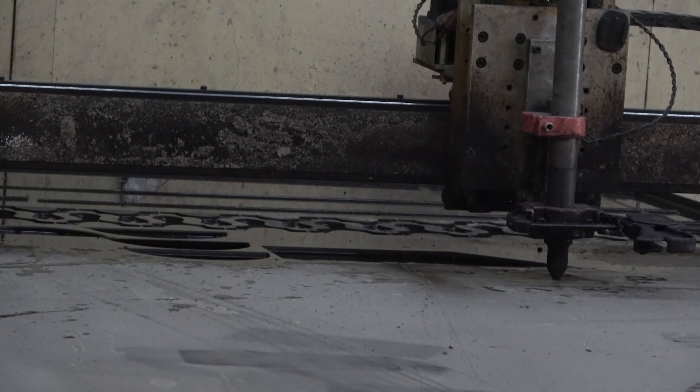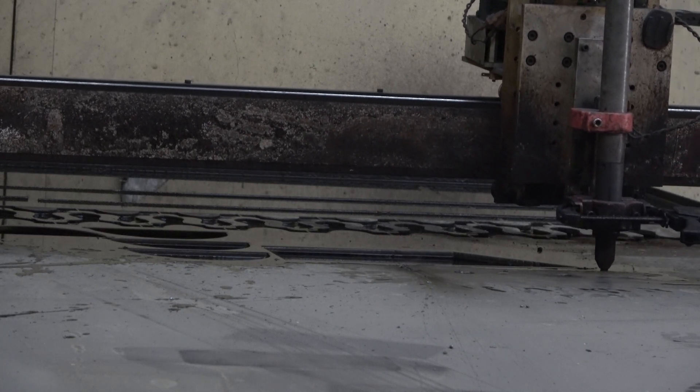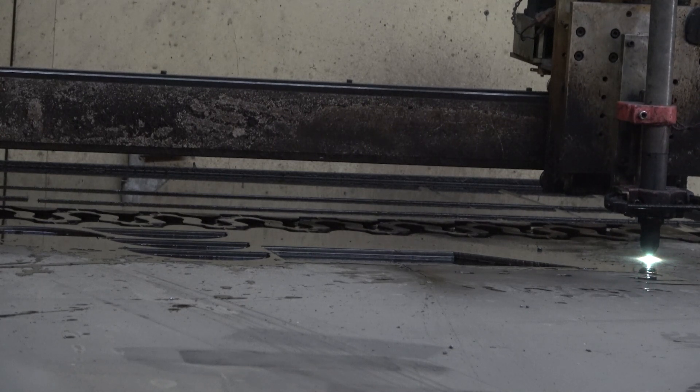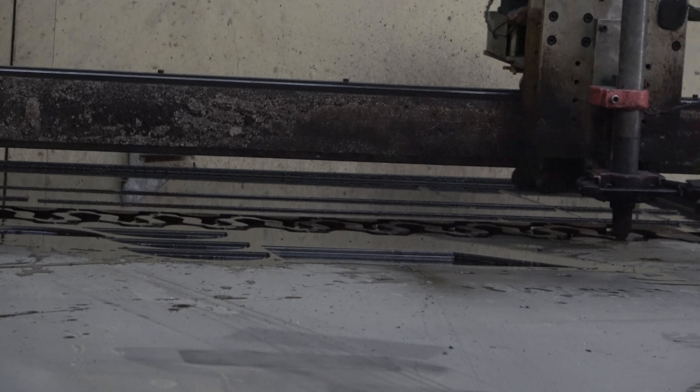It's pretty rare for me to actually catch the tip blowing out when I'm zoomed in on it, so I thought I'd leave this in here. As you can see, you get this green flash, and that's because the consumables in plasma cutting are made of copper and they're burning — that's why it's green.